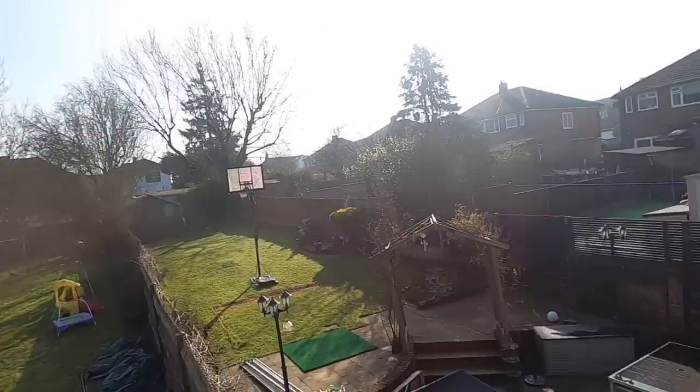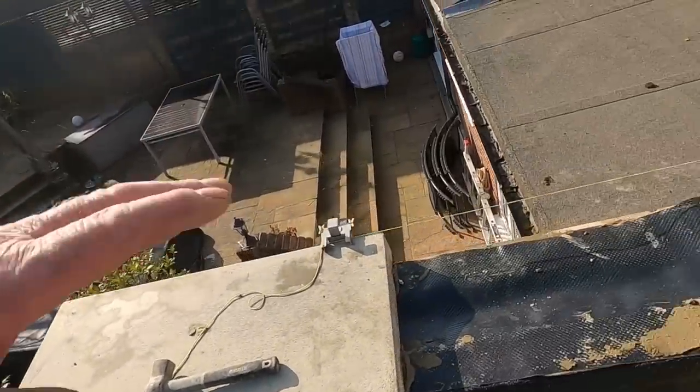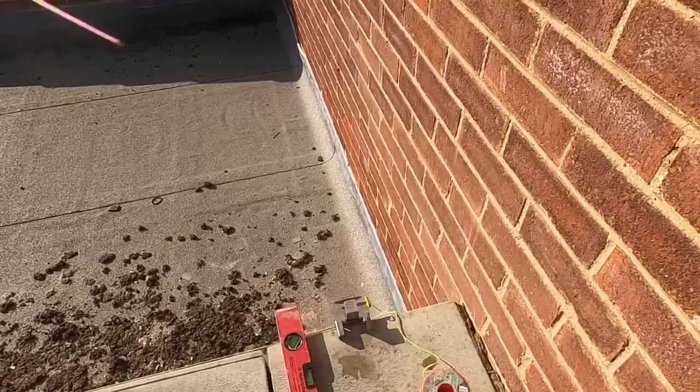Right, the coping stones, lovely day, isn't it? Look, sun's out, all that fog's gone. Right, the coping stones, DPC down there first, there's a tray underneath that. What I do, I lay them all dry, get them up here, lay them dry right the way through to this end, and I've got my cut.